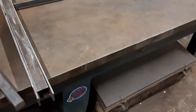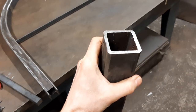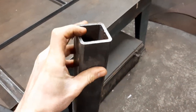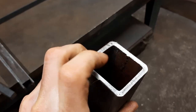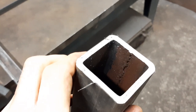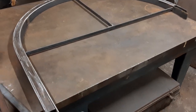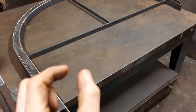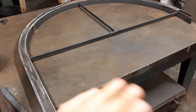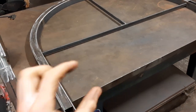So, box section — it's all one piece effectively. There's an interior weld seam in the stuff. You can see this line down here inside the tube where it's welded. When you bend it, it crushes and pooches out in some areas. What I want is curved box section that maintains its same profile — it doesn't crush up or pinch in — because I want to be able to lay it flat.